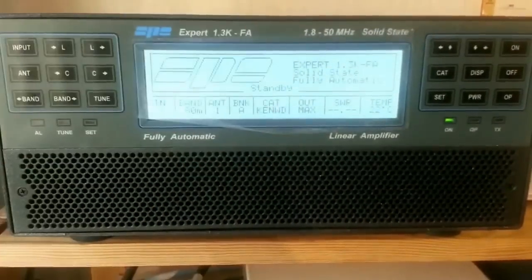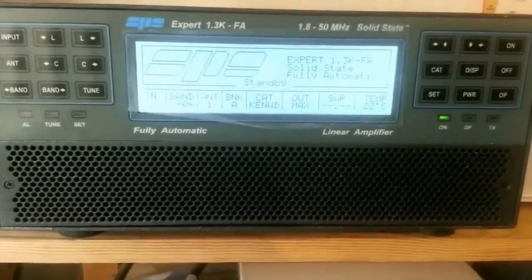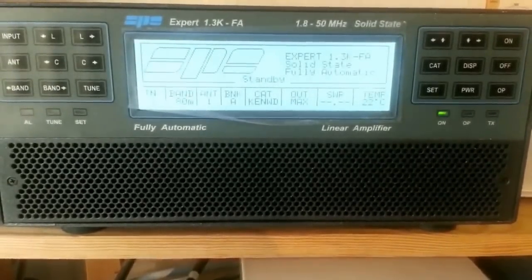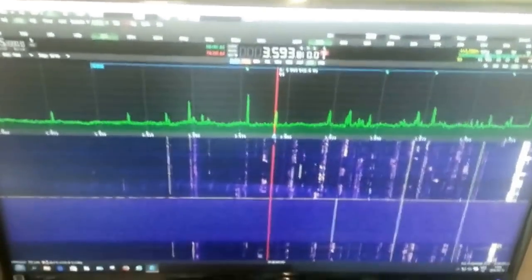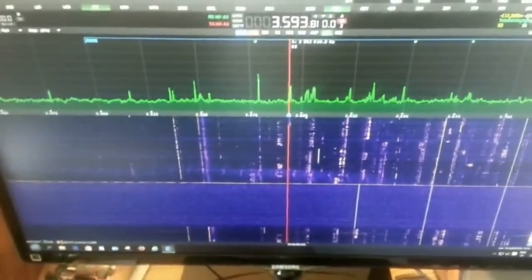The reason for doing so was that I needed a power amplifier that requires less drive power. Despite this power amplifier getting full scores on reviews, I very soon detected that it generates spurious emissions into my receiver. If you are not observant, it might not be so obvious to understand that you are dealing with spurious emissions. If you have an SDR, it of course makes it easier.